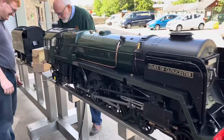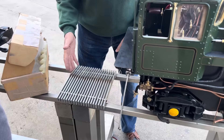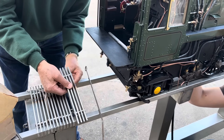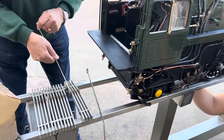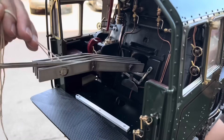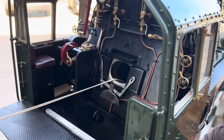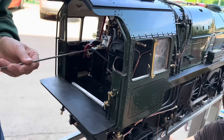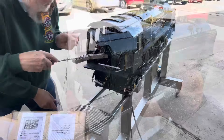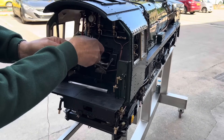Moving around the finished locomotive you can see that Ron is getting the grate sections out for the fire. It's quite a large grate area for a miniature locomotive and it goes in through the fire hole door. Ron is wrapping a little piece of string around the metal bar holding the grates together and then hooks it with a special tool so that he can poke it in through the fire hole door, drop it onto the two bars — one at the front, one at the back — and then pull the string out. Then Ron will put the poker in just to push the grate to the left, up against the left hand side of the fire box, allowing him to continue putting the next section in, right the way through until all four sections of grate are in the fire box.